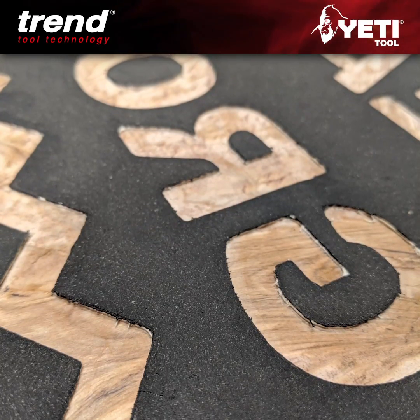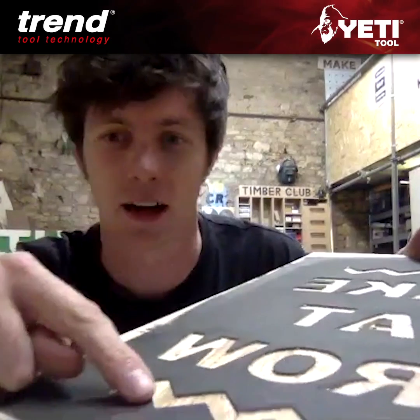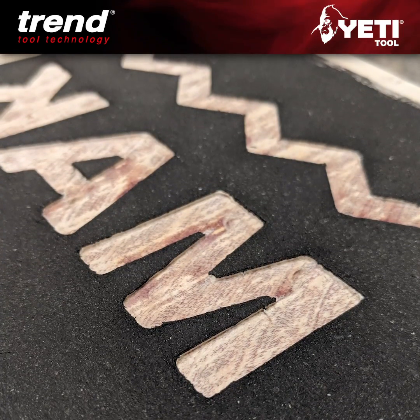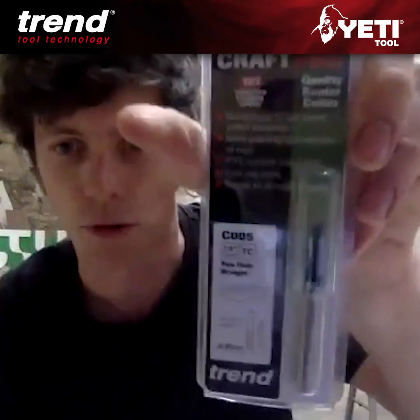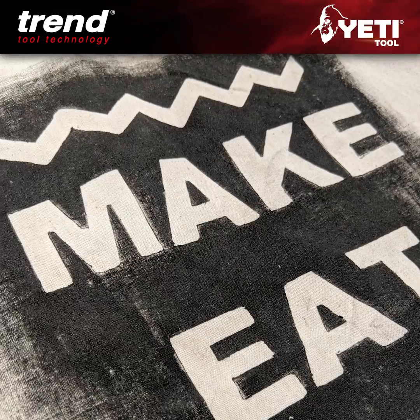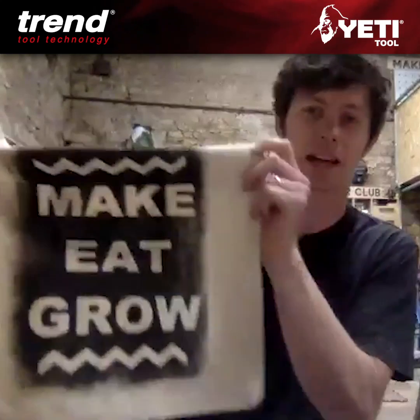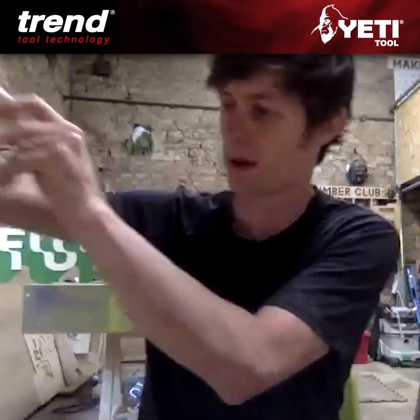My solution was I got a six mil cutter to basically hog out all the bigger parts of it, and then I swapped that over for that little two flute trend bit — that's the one I used for the larger parts. And then for the smaller parts, it was a two mil cutter. It looks grainy, but that's the sort of style of it — it's sort of perfect really.